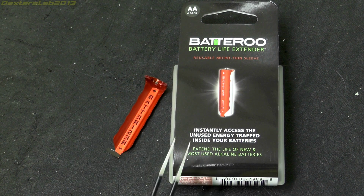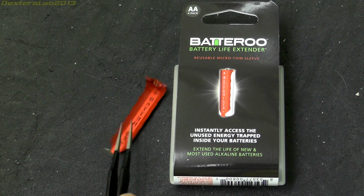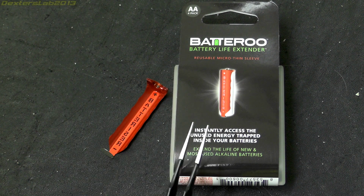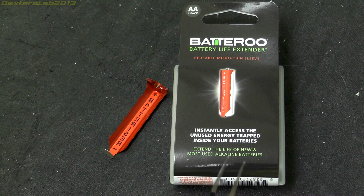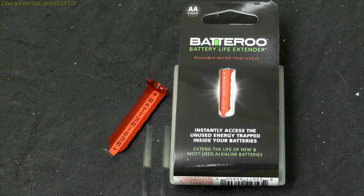Of course, this is great on paper, but it's very, very complex in the real world because the Batteroo will have its own efficiency losses. Also, as the battery voltage drops, the Batteroo boost will increase how much current it draws from the battery in order to maintain the voltage on the output. Battery chemistry, of course, plays a role in how the voltage of the battery changes depending on the amount of energy there is left in it, and it all gets horribly complicated.